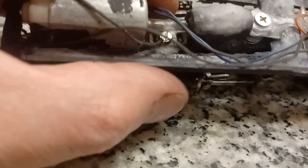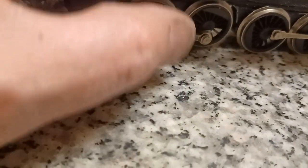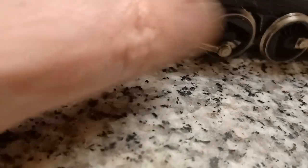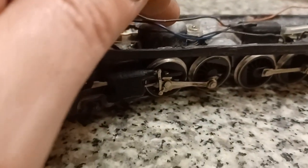Where you see the screw right there, well, there's one in the front. What I did was I took a screw that threaded into this little spark plug doohickey. I cut the head of it off. I glued it in this and then threaded it back on with Loctite and let it dry. Then I re-tapped the hole on the frame and I screwed this down like that to hold the transmission down, or gearbox.